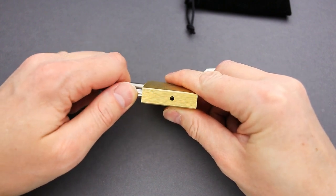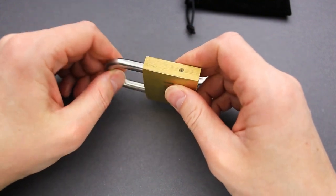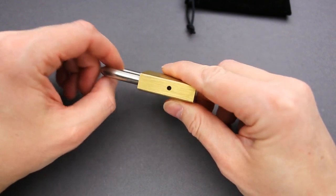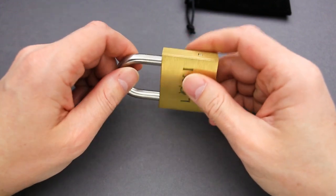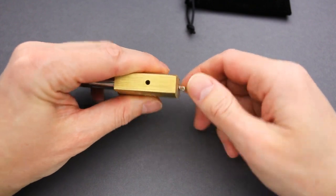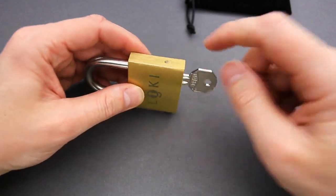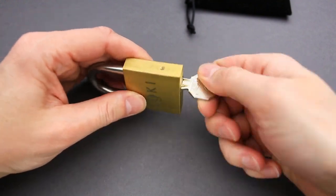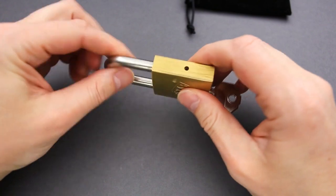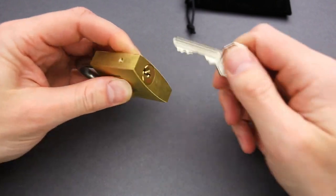I can see why. This hole in the lock is not hollow — there is a metal pin here that when I put the lock in this position, it locks the shackle, and I can see it. But when I tilt it back, the pin goes inside. Probably that's not the Allen key, just a metal pin. The pin not only locks the shackle, it also locks the key. So when the pin is locking the shackle and I can't move it, I can rotate the key. But when the pin goes down, I can't move the key — but I can move the shackle. Now I can't even remove the key. I have to figure out how to rotate it back so I can remove it.